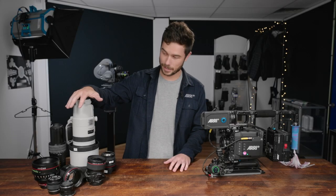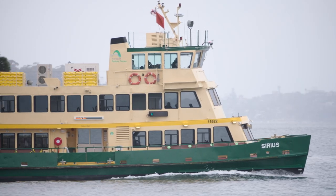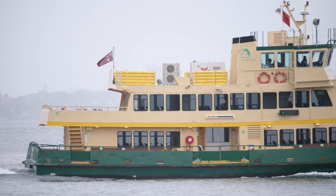That positive lock clamp ring is of particular importance if you're using cinema-style EF lenses, ensuring the lens is completely flat on the mount and that the flange depth is exactly 44mm — so all your focus marks will line up. And if you have a stabilized lens like this Canon 200-400, the EF mount will power the stabilization as well, giving you nice steady shots at really long focal lengths — there aren't very many stabilized cinema lenses, and certainly none that cover large format.